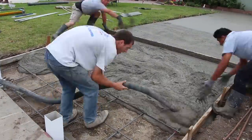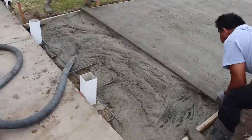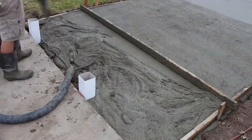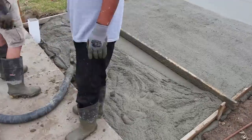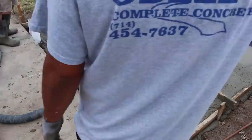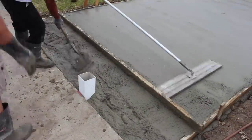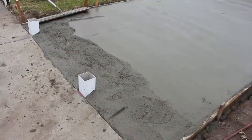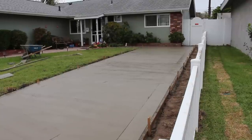There are the five-inch vinyl post sleeves I put in — they go down about two feet, so we'll cut them off flush later. The four-inch posts will just slide right in and out as needed for RV access. I left them up high so the concrete wouldn't flow into them; I'll cut them off later.